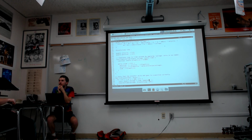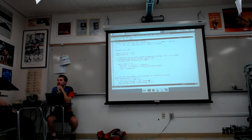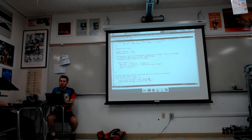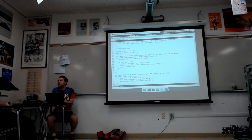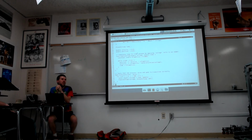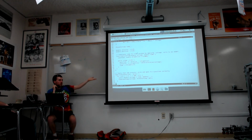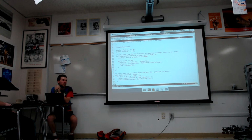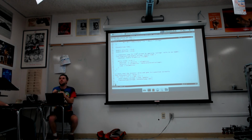No, we have to write that code, which is what we're going to have to write our update function so it does a zero procedure. So it's going to be wherever we turn it on. You guys following that? I see at least one nod. Okay, because that one's key. When we turn our robot on, the encoder starts at 0. Right now, 0 could be at the bottom, or 0 could also be halfway up if you turn it on there. So we need to simulate that correctly and make sure we handle that.